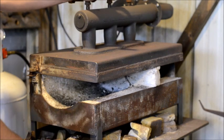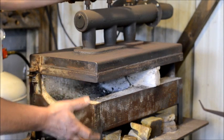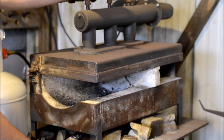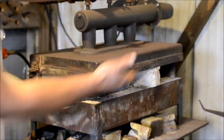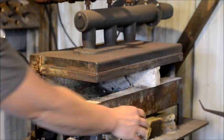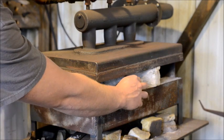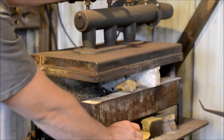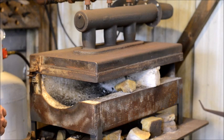Well, anyways, we actually demonstrated in it, and we were doing a big park bench, essentially, is what our demo was. And I fell in love with the forge just for its capabilities of how well you can run stock all the way through it. You can make use of closing in the ends. You can brick it in and just use the side outlet here, or you can brick all the side open and have just this area here open to be insulated. And it also has control of all 3 burners separate.